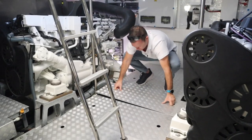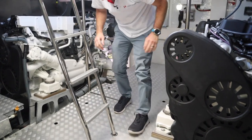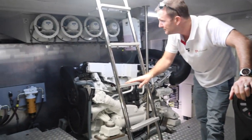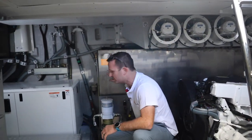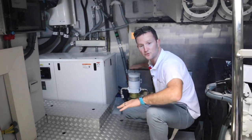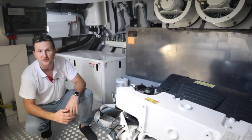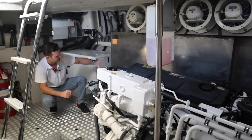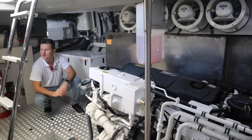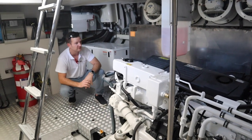Checker plate flooring is a very nice attribute in this area — all anodized aluminium. Coming outboard on both sides, we've got two fuel tanks, all centrally balanced through a balance line. There is 3,600 litres in this boat, distributed evenly on either side. Racor filters, secondary filters — this engine bay is equipped with big-boat technology in a small boat, which is really nice.